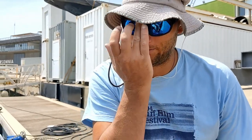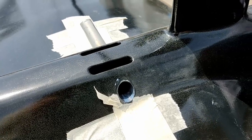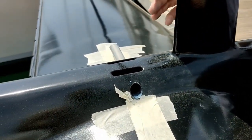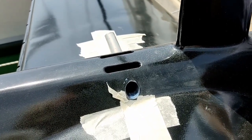Oh, there you go. Well, I have noticed there's quite a bit of teff gel showing up on the boat as opposed to Duralac. So yeah, now I know why. And I will actually use Duralac like a yellow Loctite. I started nicknaming it. So if you want a screw to go somewhere and not fall out, but you don't want it Loctited with the full strength of Loctite, and you want the galvanic corrosion resistance, Duralac is actually a good option.